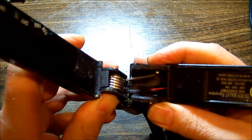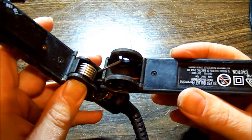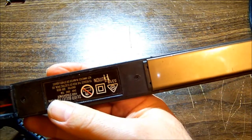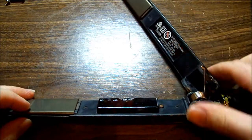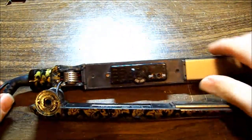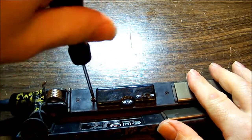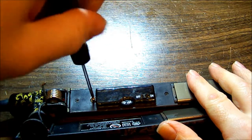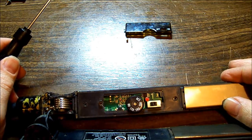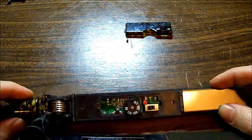So there we can see the mains cable coming through there, from the pivot connector through the hinge. Actually no, sorry — it's not the mains cable, it's the control side there. That's just a wire feeding the heating element at this end. So the next step will be to unscrew the cover to the control side. I've got one screw here. I may not need to take this whole cover off — it does give ready access into the board — but it's probably a better bet to remove these two screws here and take the whole piece apart so we can trace it through better.